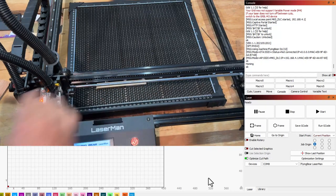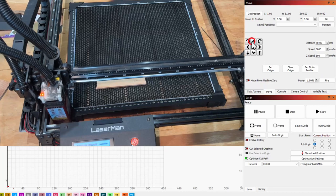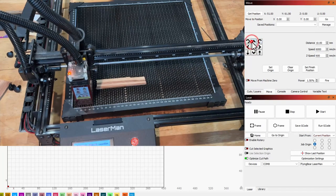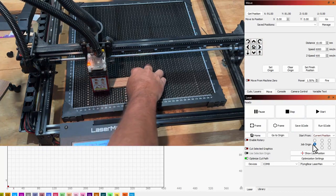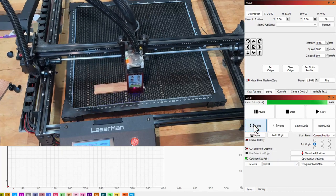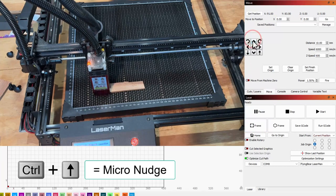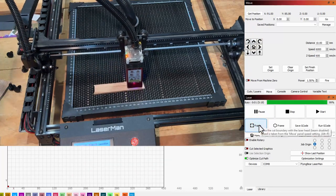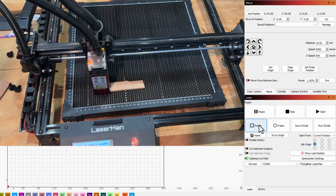I'm gonna move over here so we've got a good view of it on camera. Let's use the move command to do a shift nudge to get it out there. I'm gonna go up a couple clicks so we're sure it's in the camera's view. I've got this set to go from the middle edge. Let's hit frame and see what this looks like on the laser — just a tiny bit low. Let's do a control up to move forward, try two clicks. Let's frame it again — that stayed on pretty darn awesome. I'm gonna adjust it a tiny bit and watch it one more time, making sure we've got everything pretty square.